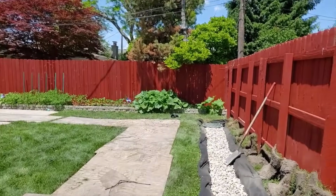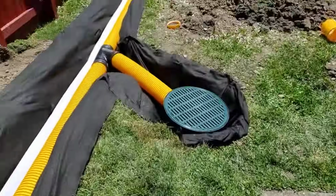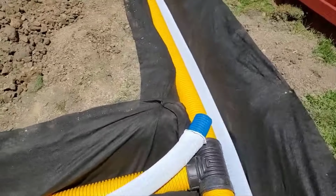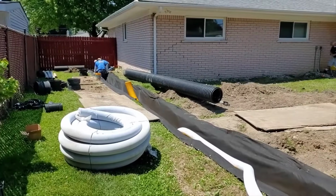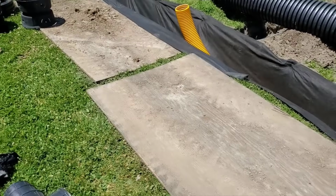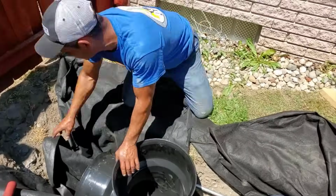My subscribers are talking about it all the time. And you've seen the sleeve and the sock, that white material, we call that a sock or a sleeve in the industry. The blue high octane is inside that. That's so those little stone chips don't plug the inlets on the high octane, because we all know dirt washes right through high octane. Dirt has no problem washing through high octane. I don't care how dirty the stone is, because I know all the dirt is going to wash right through it, go through our pump system. Our lift station is going to take it and just pump it out into the front yard, which you're going to see here soon.